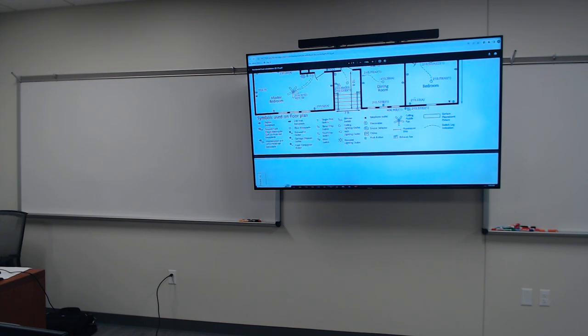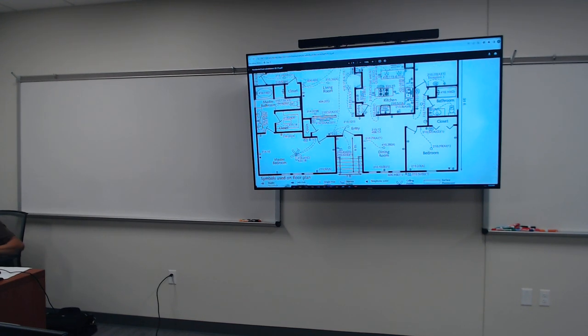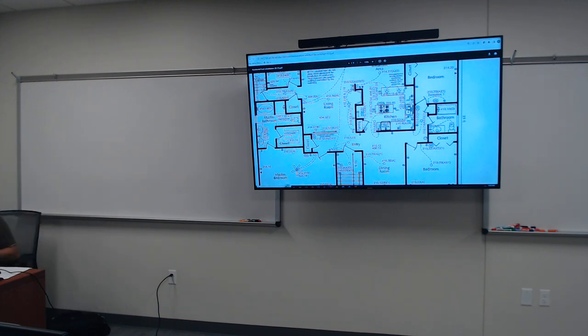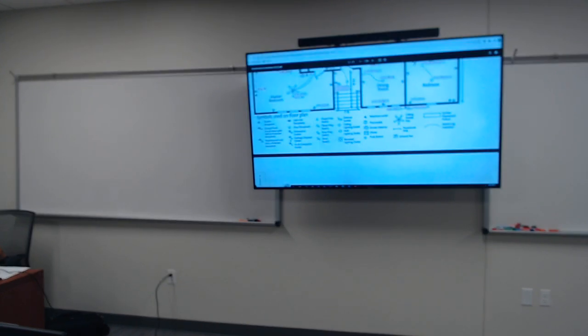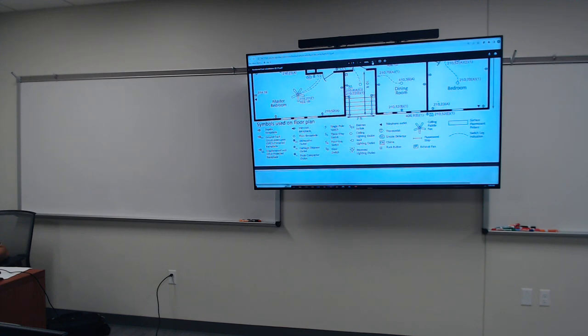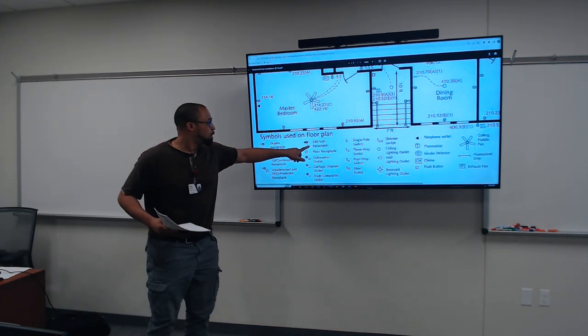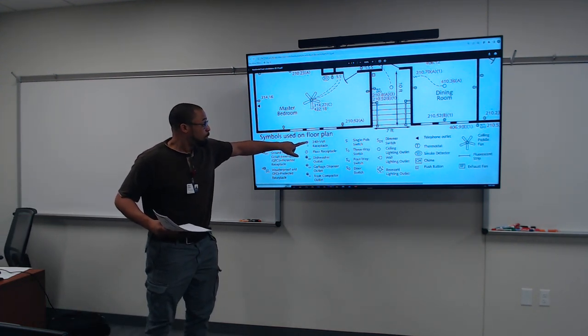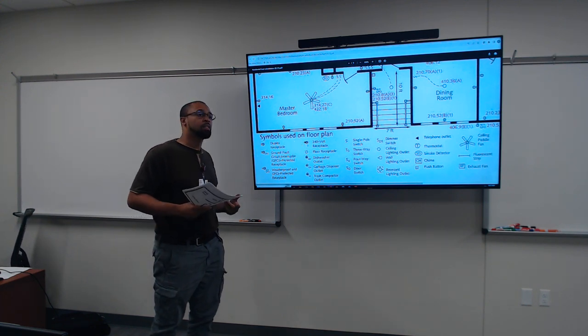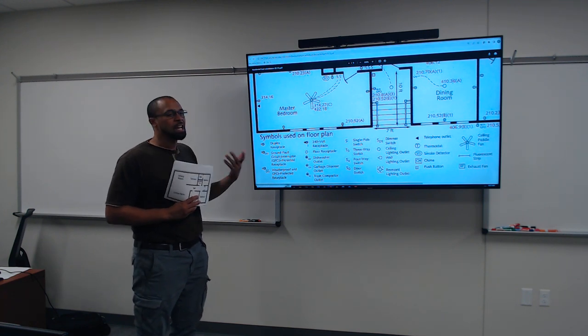this big example, you have the symbol. So when you guys go in your laundry area, especially when we do the practice, all right, if you look at your laundry area, you're gonna put a duplex receptacle for your dryer, right? So if you look on here, let me blow it up. Okay, there you go, right there. You're gonna put a 240 volt, which is a circle with three prongs coming out of it, indicating that it's a 240, which will be located in your laundry area.